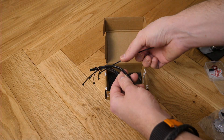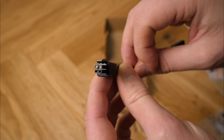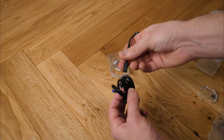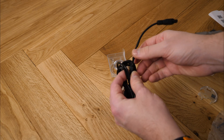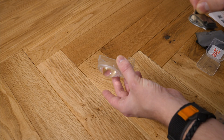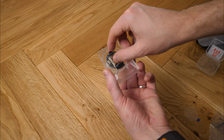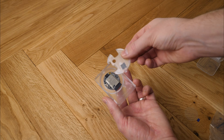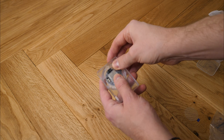Inside the box is an adapter for the cable — this just plugs in and converts it to the AMS connection, allowing you to draw power from the machine. Don't lose this one otherwise it won't work. The two cables join on one end and they have a tab so it's really impossible to get it the wrong way round. To assemble the screen portion, put the lens into the case, then place the screen in facing the correct direction — the USB-C port has to be at the top. The clear bracket that holds everything in place has cutouts and even points out where USB-C goes, so it's hard to get wrong. Once you line it up it'll just clip into place.